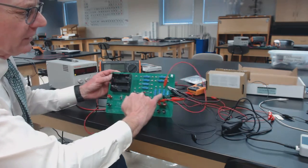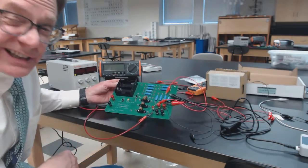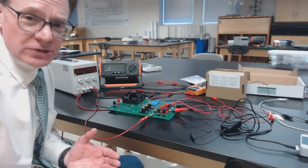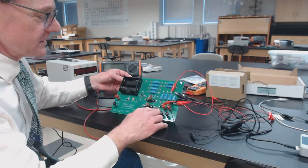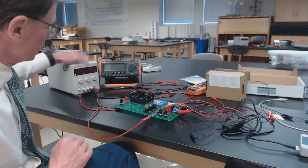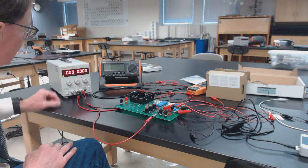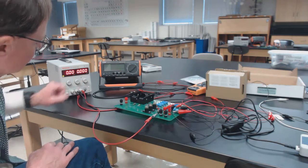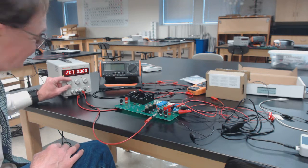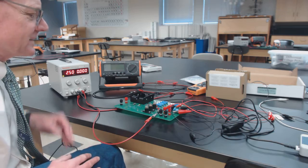We've got three resistors here — we're going to use the three larger resistors on the board in series with this capacitor. There are actually a lot of different ways we can hook this up and run this experiment. We need some kind of switch to start charging or discharging the capacitor. This is the power supply that we had before from week one, and I've got everything turned down. The current limit is turned all the way up and I'm going to power this up to around two and a half volts.